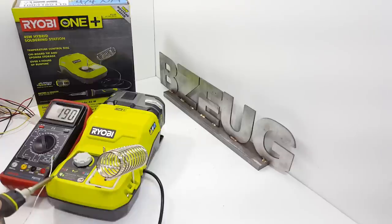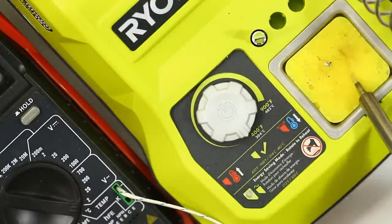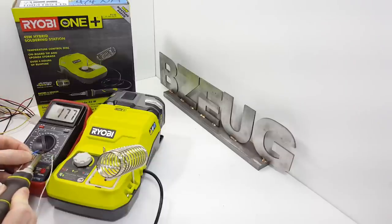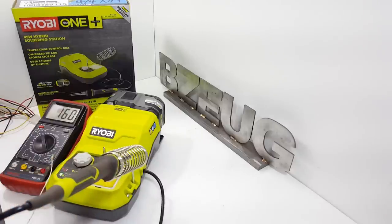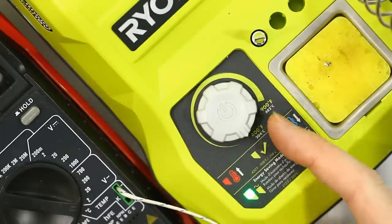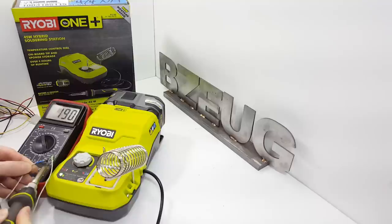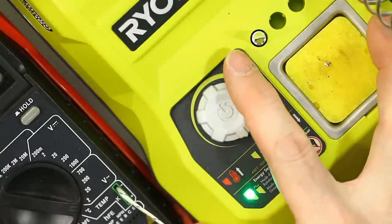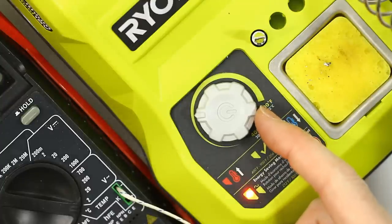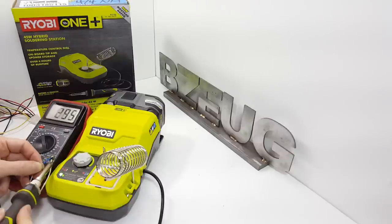We went into power save mode — so here's power save. The tip temperature is still dropping. Calculating battery life is going to be very difficult because of how often you take it out of power saving mode. Tip temperature is dropping below 200 now, so I believe it's turned the element off. To kick it out of power saving mode, we just move the dial. It goes red, then the green light stays solid green, and the tip temperature comes back up.